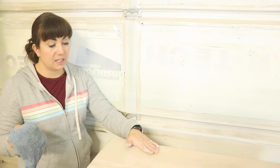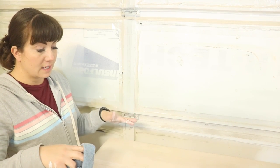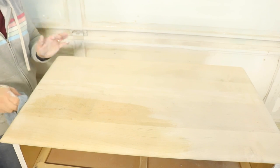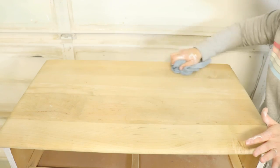This is four coats of bleach and dry. We're going to go ahead and use a damp cloth to neutralize that bleach and get it ready to seal. My rag is just damp with water so it won't interfere with the sealer.